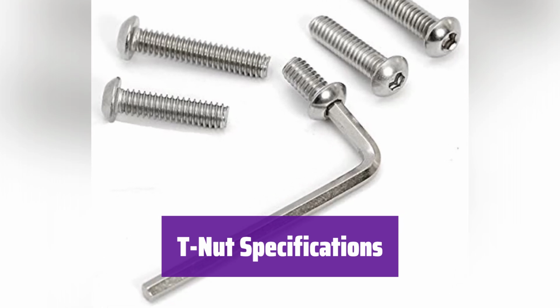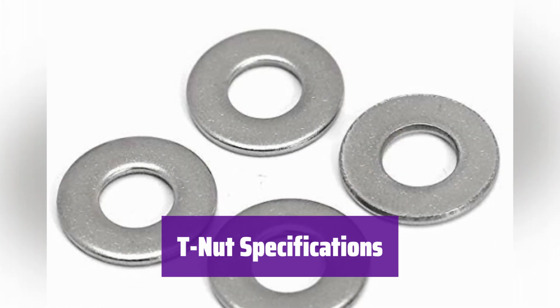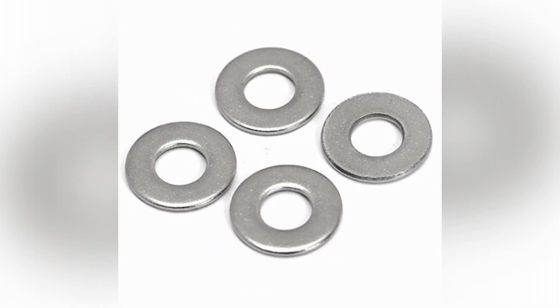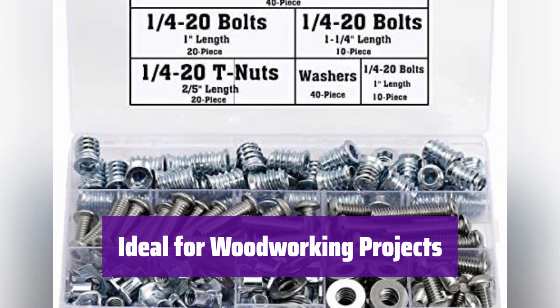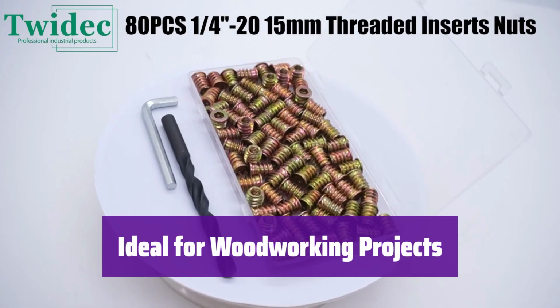The T-nuts have a barrel height of 5/16 inch, a flange diameter of 11/16 inch, and an overall height of 3/8 inch. These dimensions ensure a secure and reliable connection. This kit is perfect for both professionals and DIY enthusiasts. It simplifies the process of creating strong, lasting wood joints.